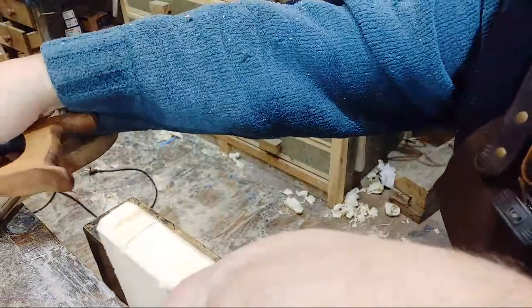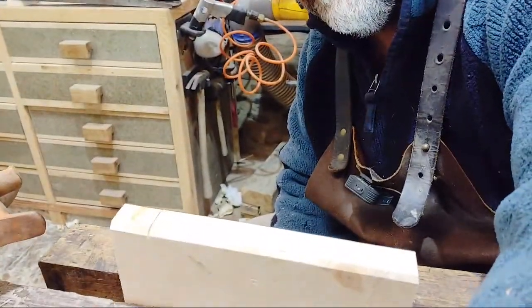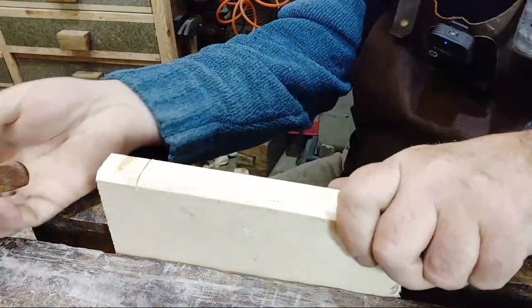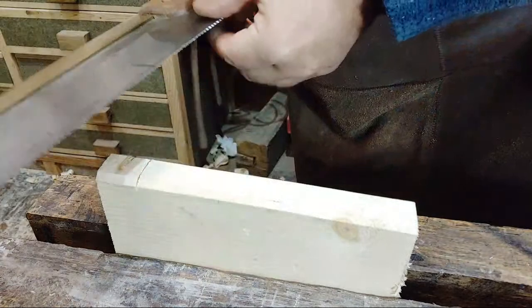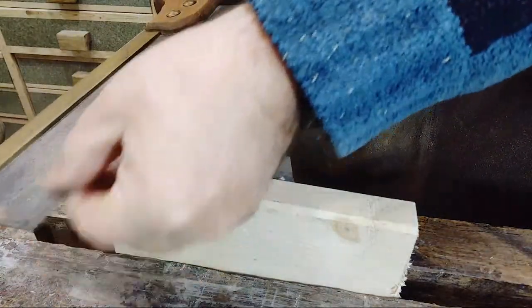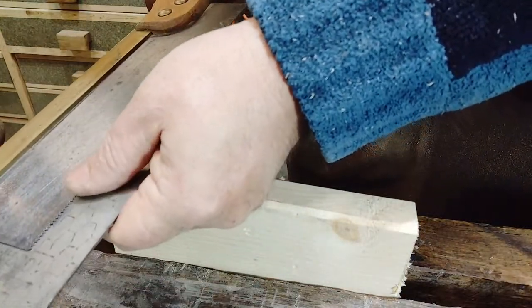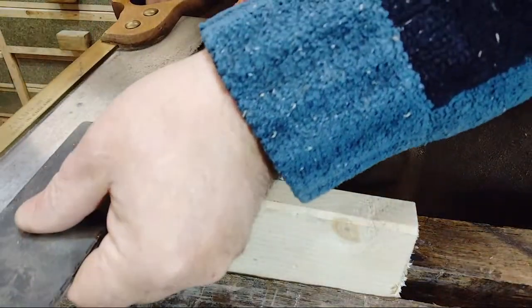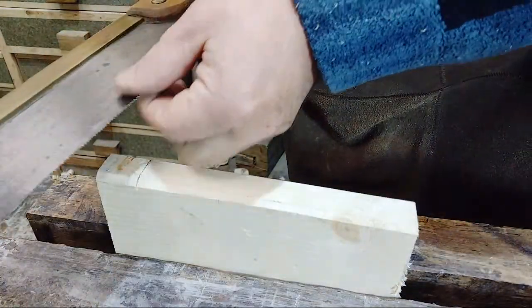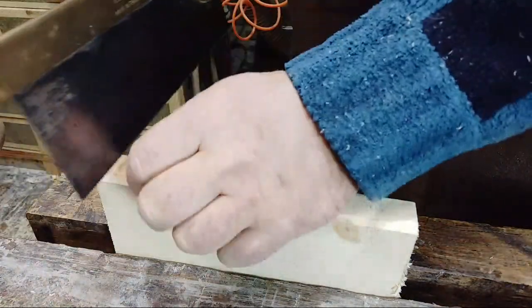At the beginning of this video, so I've got a bit of wood. Old pine, it's the worst wood to cut. So what I sometimes do, I quite often use a fine diamond or even a bit of emery paper, just one stroke on each side. It's a bit like when you're honing a plane iron, because you're creating a burr. If you don't remove that a little bit on those peaks, you'll end up constantly grabbing your bit of wood.